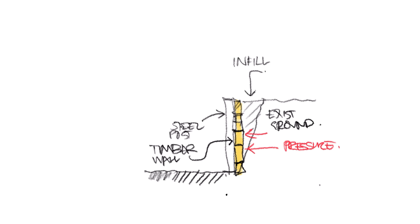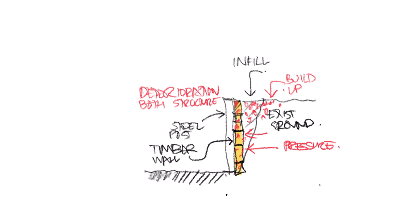There is also the likelihood of leaving the area behind the wall permanently moist, which in turn will weaken the soil and its inherent load-bearing structure. The wall itself will begin to deteriorate at a rapid rate since it's permanently damp, and visually it's just going to look a mess — when timber deteriorates it looks awful. We get all sorts of green moss and black marks.